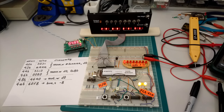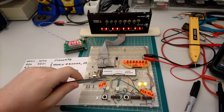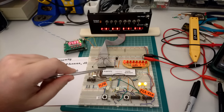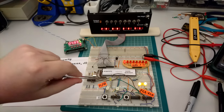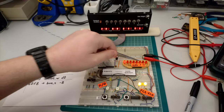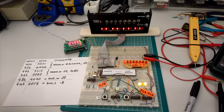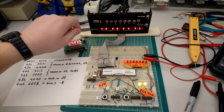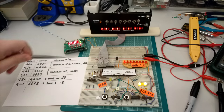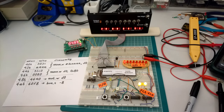And now you will notice that first of all, this LED has turned off, so we're not actually trying to read from memory this time, but actually writing to memory. The address at which we're trying to write is exactly the address of the I/O device that we have specified previously, so that's 80 hex, and the data lines contain whatever was in D0, which was the immediate value that we have loaded previously, AAAA.